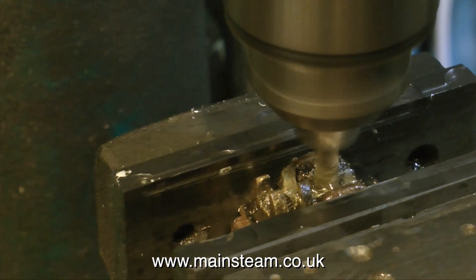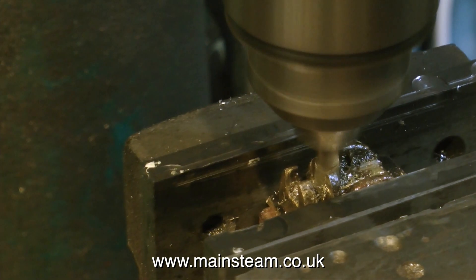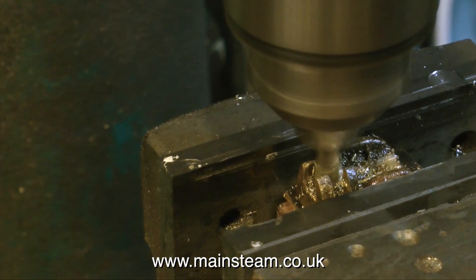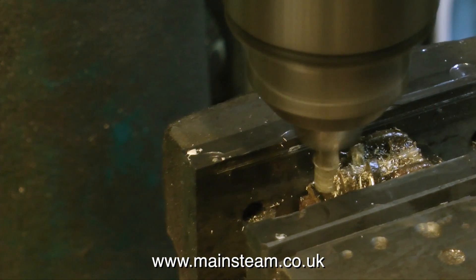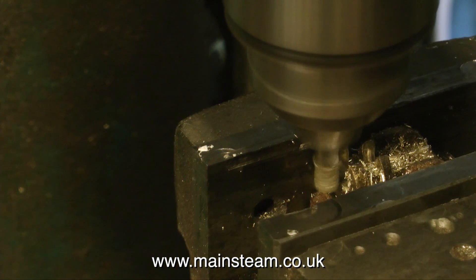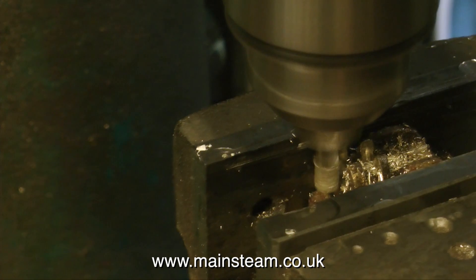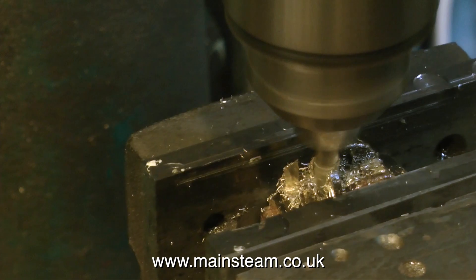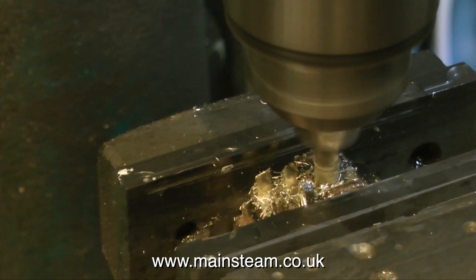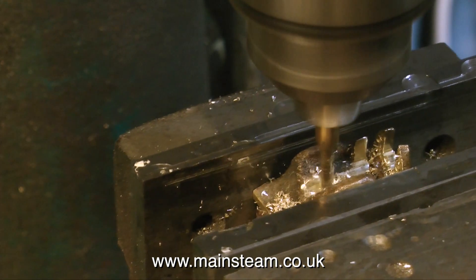So what I'm going to do is remachine the valve properly to allow sufficient clearance for the valve to float. To make sure once and for all that this valve floats in the steam chest as it's supposed to, I'm machining the valve not only crossways but longitudinally. I'm finishing it off with a milling cutter with a rounded cutting edge, so there's plenty of room now for the valve spindle.